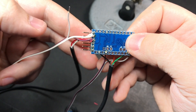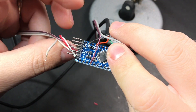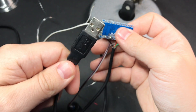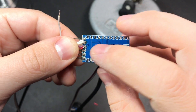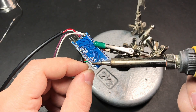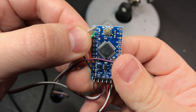I've connected two sets of wires to the VCC and ground pins on my header pins. One set goes to the relay and the other is the USB plug for powering the board. I did it this way so I can still access the header pins to reprogram if needed. Be careful not to bridge any neighboring pins. This third wire goes to pin 12, which will control the relay.